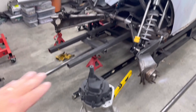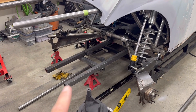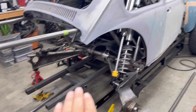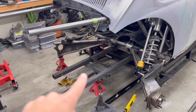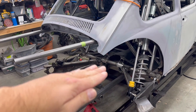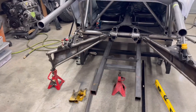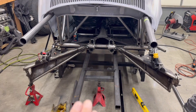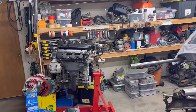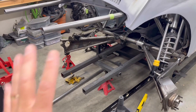I know that I want to tip this transmission five degrees, engine side up, but I don't know how that's going to correlate to the actual mounting yet. Right now these two tubes — this fixture — is level, so I've got it at zero with the rest of the car. I want to create as much clearance underneath right here as I can, so once I get this transmission tipped at five degrees, I'll be able to see if I can bring those tubes up at all. If I can't, that's okay — I'll just run it at zero degrees, level with the rest of the pan, and kick it up as soon as I can to clear the engine. So that's what I'm going to get started on right now. Let's see how it goes, and I'll stop and talk through any weird stuff that I find.